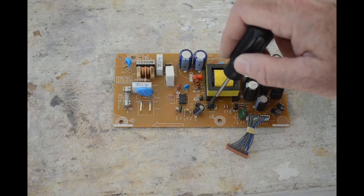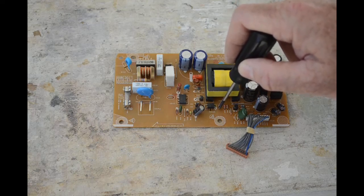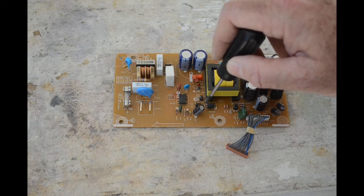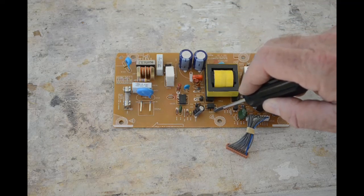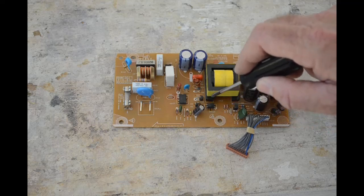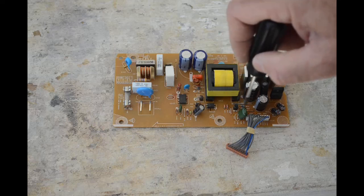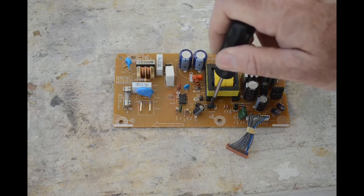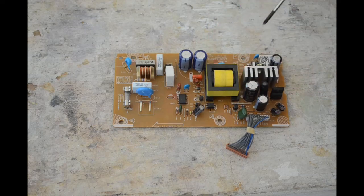They'll have an LED here that's sending a signal to a photodiode or phototransistor on this side, and they're totally electrically isolated from each other. In fact, you can see there's even a little break in the board right there, so that there's no connection between this side of the board and this side of the board to let the signals through. So that's where you'll find most of your phototransistors. They're buried inside other things. You won't see a lot of them on your electronics.